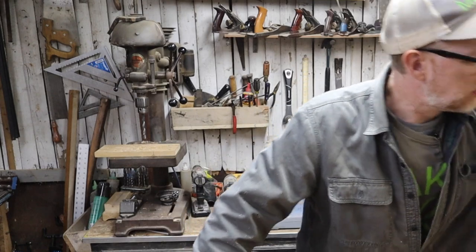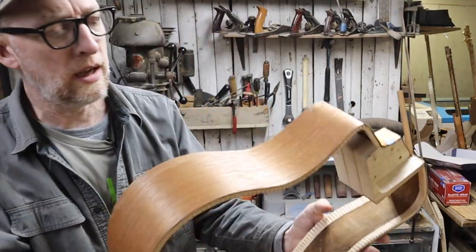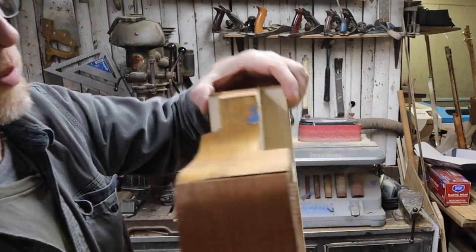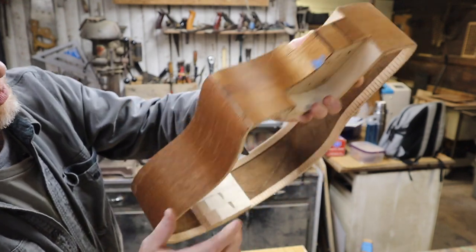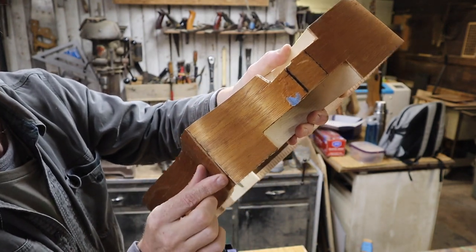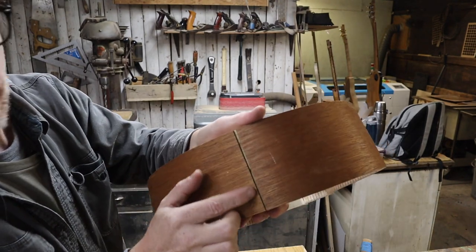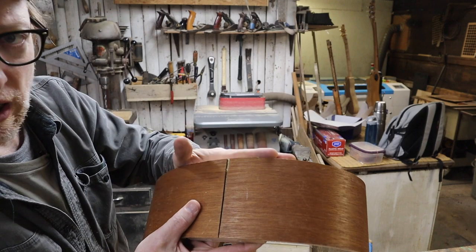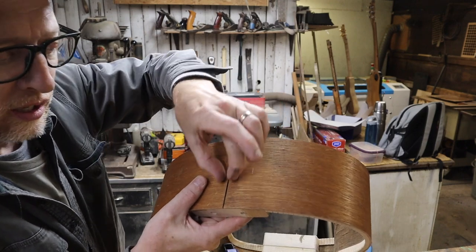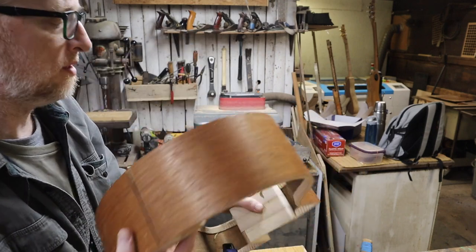So this is what I made last time, and you can see it came out and it all worked. But you can see I have a couple seams here because I did that wrong. This seam looks fine, but then I got this crack here that I would have to fill. The idea is I'm not worried about making these perfect joints because once the box is together with the top and bottom, I'll use a router jig to clean that all up and then put a nice piece of decorative wood in these spaces.